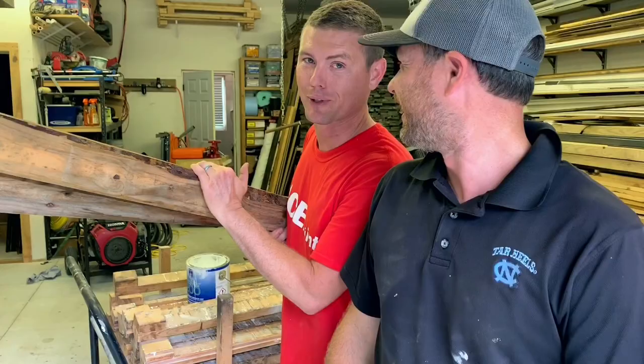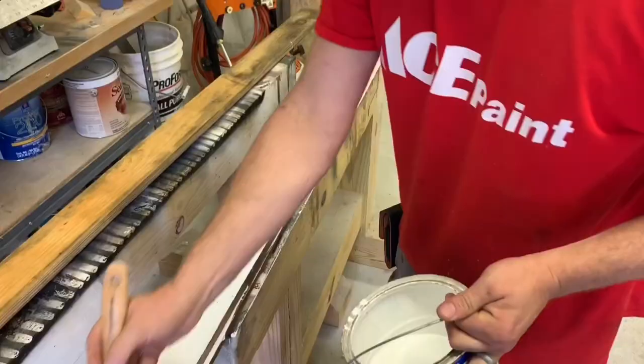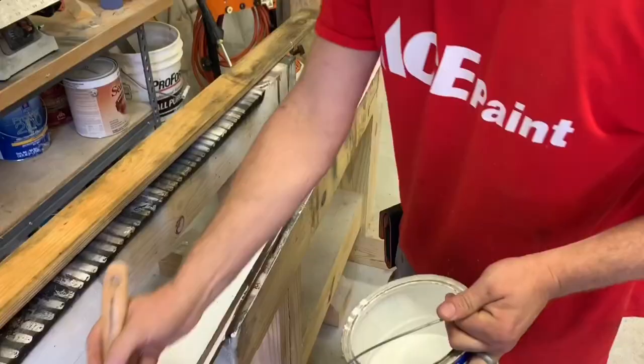You need to stack them apart. I'm going to paint them and stack them flat right now just to show you — and these will take about a week to dry like this, if they dry at all. You cannot flat stack boards with wet paint; it will not work and you'll ruin the board. That's why if you don't have a drying rack you need a huge area to lay all the boards out flat.